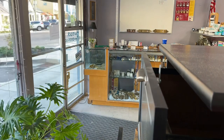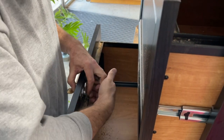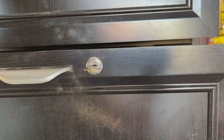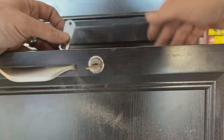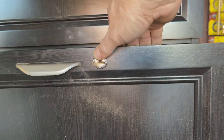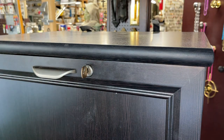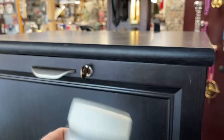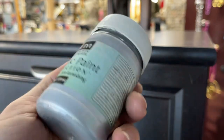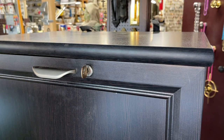We've got to find the other cam. Let's put this one in with a temp, just to see. Let's bring the camera over here. Again, this cam is too long — we're going to take this top drawer out in just a minute to show you. It's going to have to be cut down. You have to mark where your cam is going to hit. Lipstick is pretty popular for that. However, on dark wood, another good thing would be metallic paint — that's just what I have. Really it's whatever you can find that isn't dried out, especially if you don't do it often.